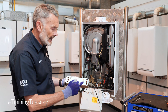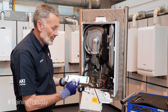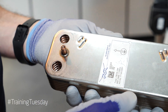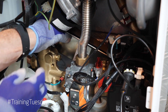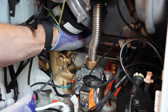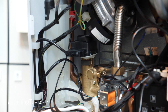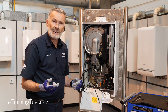We just need to make sure that our securing lugs are in the correct orientation. To the right we've got our lugs which are in line with our outlets, and to the left it's slightly offset. To replace it, we simply slide it in, relocate the lugs, and replace our fixing screws. Again, a nice and simple job here on the 600-800 Baxi Combi range.